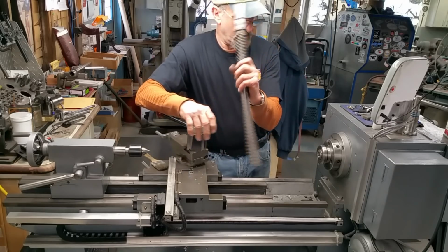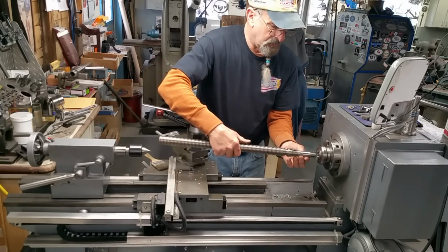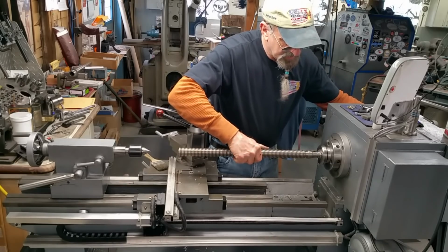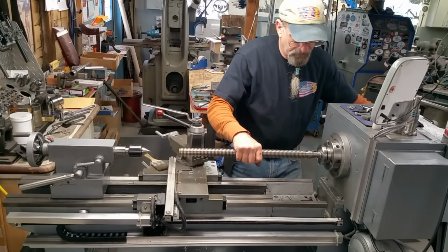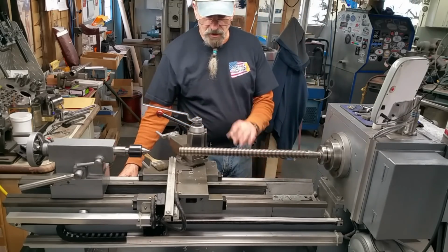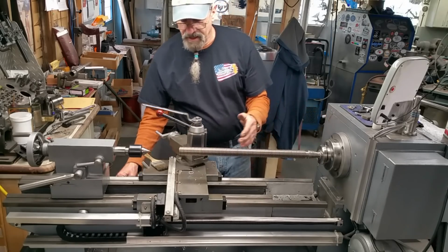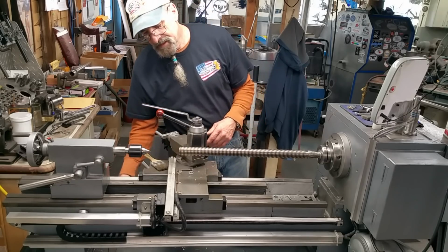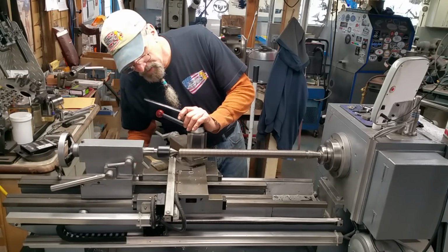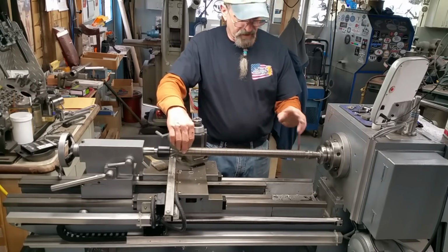We turned it around, and before we put the collet in there, we polished this up because we had some three jaw marks that were put in there before we got it. I got a nice 7/8, or 15/16, collet in here, and we got a good support right there. Now this will show you how much runout is actually down in here. We had 90 off of the other end, and that center hole is about a quarter inch there. We're gonna have to somewhat pull it over to get it started in here when we get that heat generated.